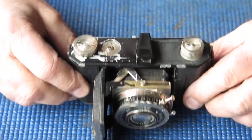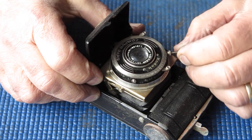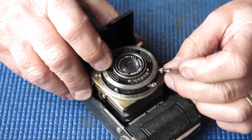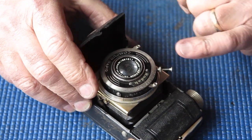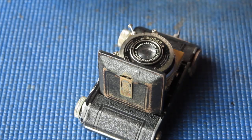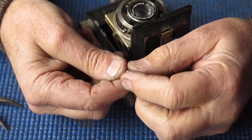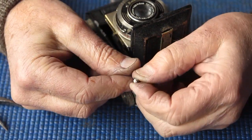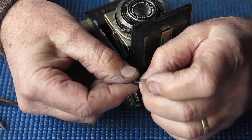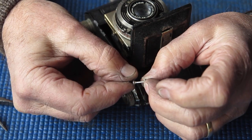Set to rewind, yes, the spools will rotate the other direction. So it's a tired little camera. The shutter certainly needs work — that plunger is sticky, which is extremely common. Very likely the shaft is slightly bent and that's why it's jamming. There's also a little ball on the end of that shaft that wears because it bears on a flat plate rather than rolling nicely. And I can see that shaft is obviously bent — I can't push it through the hole.